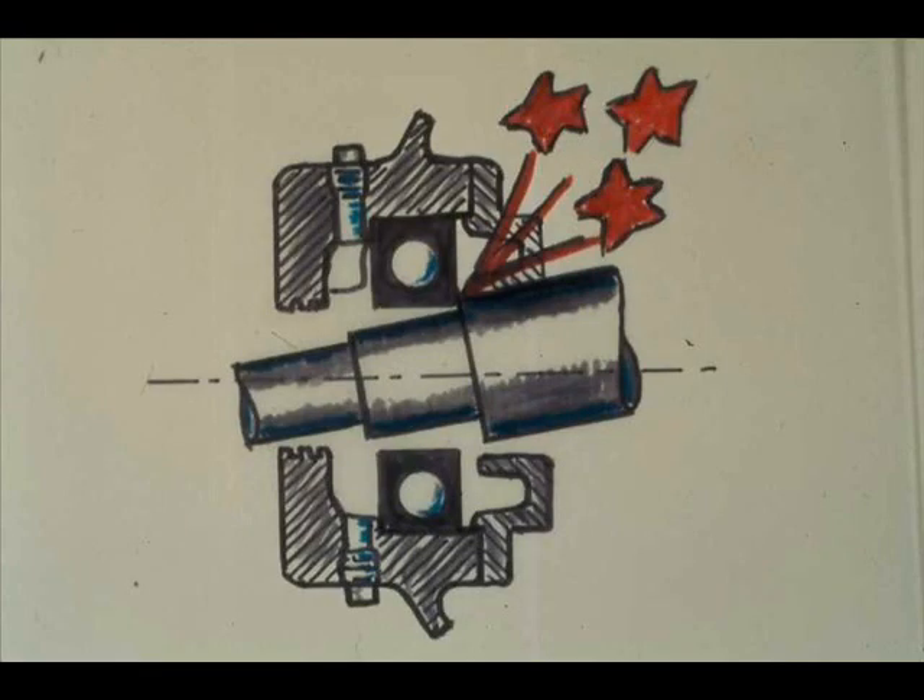Rapid knocking is probably caused by misalignment, causing the shoulder of the shaft to pound against the bearing end. Realignment must be done by trained people.